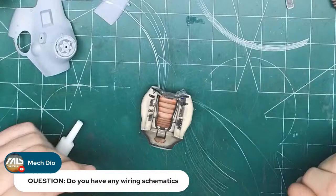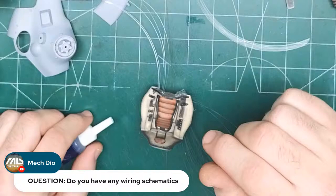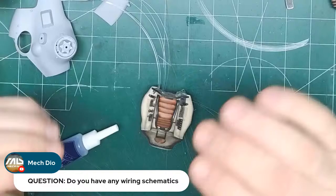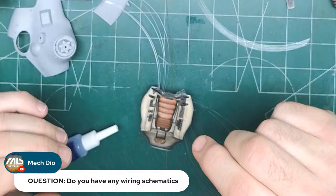I did it by accident. I was doing that same commission I was telling you about, that Millennium Falcon. I was showing somebody here at the house. I'm like, hey, check these lights out. And I'd forgotten that one of them wasn't in series yet. And I hit it with 9 volts and I heard it go. That's all it was. It went pop. And it turned black. I mean, it was done. Not even a second. Just barely touched it.